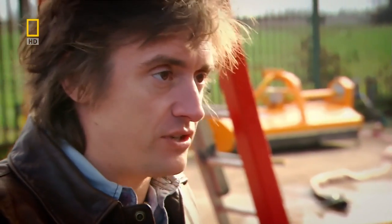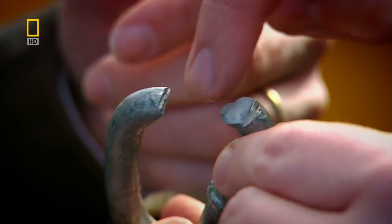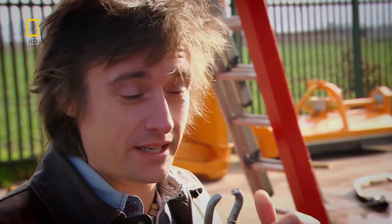It's inherent to the design of the chain that the material here is going to see a shear stress that's going to cause it to fail. This shear strain — this bending — every chain has that weakness at that point. And that's what costs lives down the mines. A failure that catastrophic and that quick. And that's where a great invention for a German silver mine comes in.